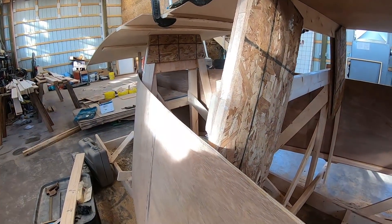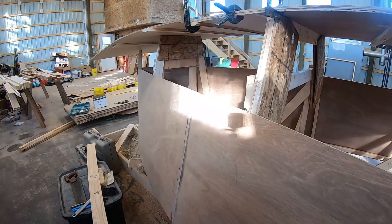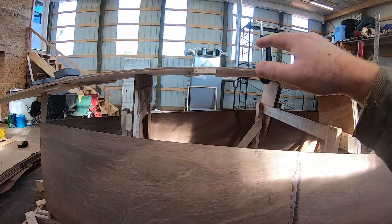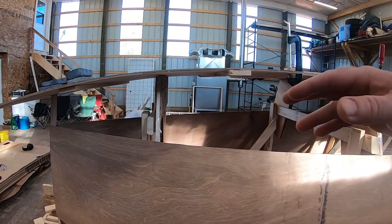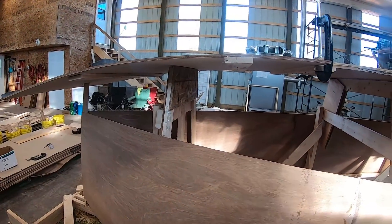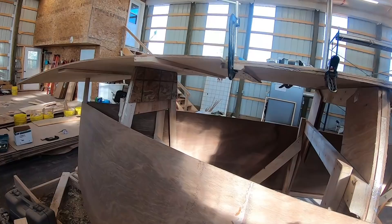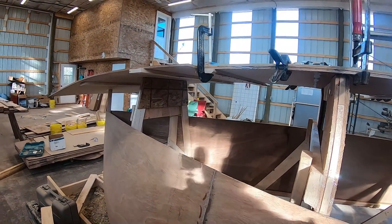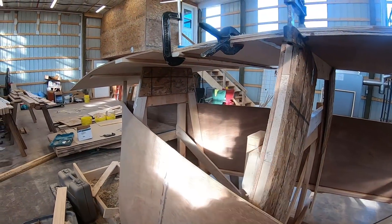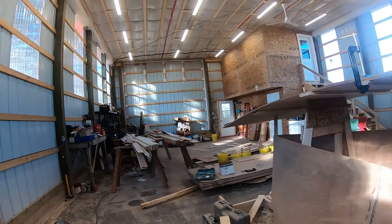When I reported this to Andy the naval architect, he took a look at the drawings and saw there were in fact two mistakes. What had happened is we had altered the bottom of the Wave Rover 650 to make it easier to build without affecting any performance, and when that happened, that change didn't make its way out to these temporary frames. Andy assures me it was corrected the very day I reported it — indeed it should have been exactly one inch off and half an inch up there. In a way, it tells me I've been doing a pretty good job on accuracy.